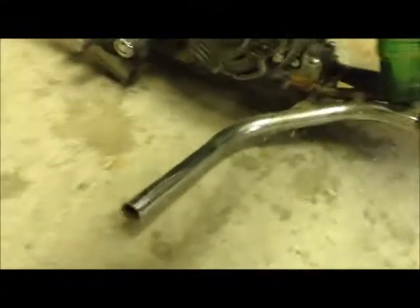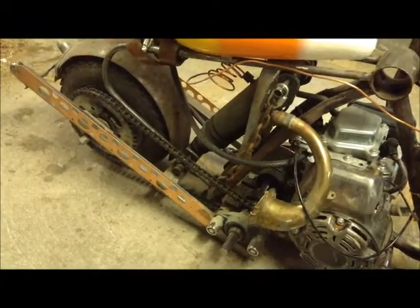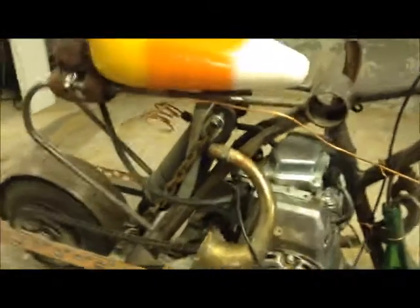I've got these BMX bicycle handlebars I made for the footrests, welded to the frame. The rear shock perch is actually a fork from the 1950s bike — I just welded it to the frame. These chains are limiting chains so the suspension can only go up so high. I'll lift the back up now, and the chains pull tight so it's rideable.